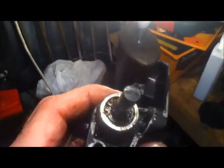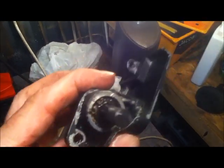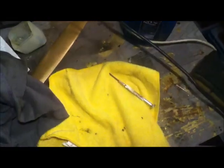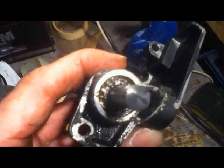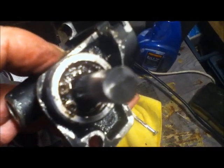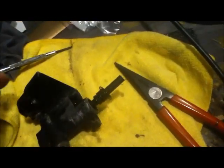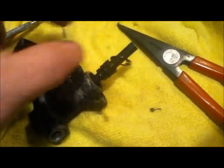It's pretty stiff — there we go. I need to replace that o-ring; you can see it's quite crusty and everything needs cleaning. Then I'm going to clean inside the unit again with white spirit to get any bits out. I've been struggling to get the circlip out — it's seized in there. I've been using a sharp screwdriver to clean it up, and now I need a decent pair of circlip pliers because the cheap ones I've got just aren't doing the job.